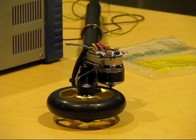That's it. That's all it is. It doesn't even have to be aligned. No alignment at all. Because the phase alignment is going to be constant, but once you run the motor once, now you know exactly what the map is. You're all done.